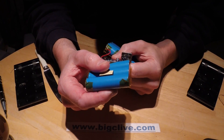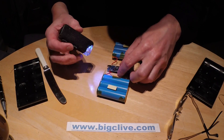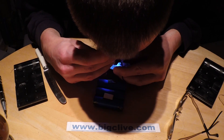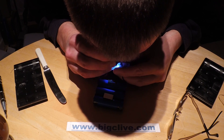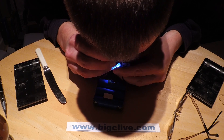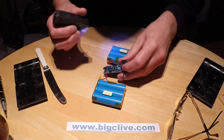Do they have numbers on them? The microcontroller does not have a number, but the chip connected to the coil does. Looking under the microscope, the marking reads S14606 — or possibly SI4606 — followed by what appears to be N4G20. The probably important number here is the S14606 or SI4606.